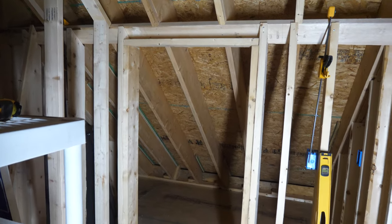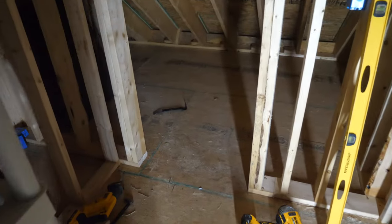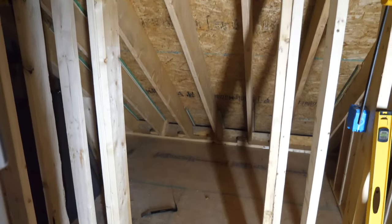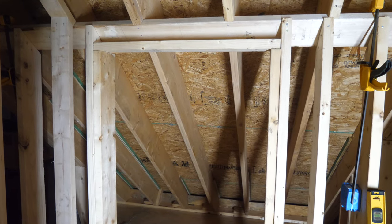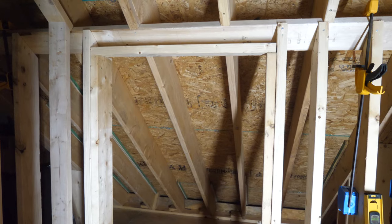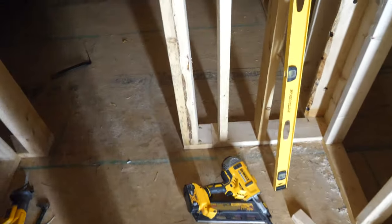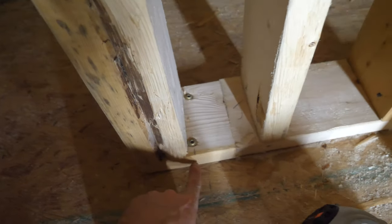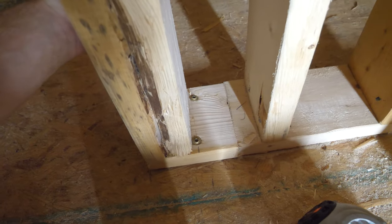It's all done and honestly you can barely tell it even changed. You would not know unless you looked really close — and the best thing about this is I didn't have to use any additional lumber. I was able to take all the pieces apart and put them back just a little bit shifted to the left. I did have to add a little extension to this sill plate here, but luckily there's a joist running right here so I just put two lags in that and this thing is solid as a rock. Just for a little pantry door, I think it'll work.